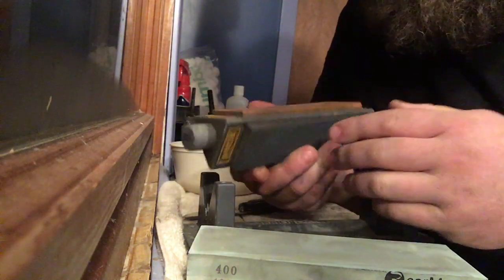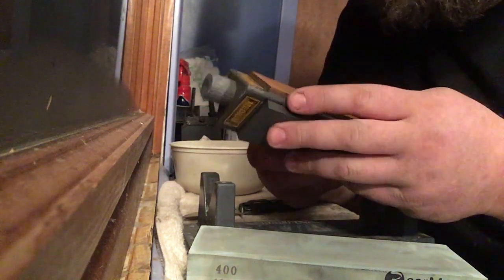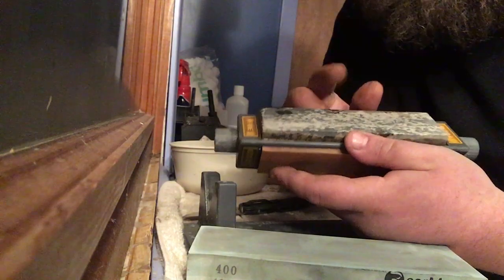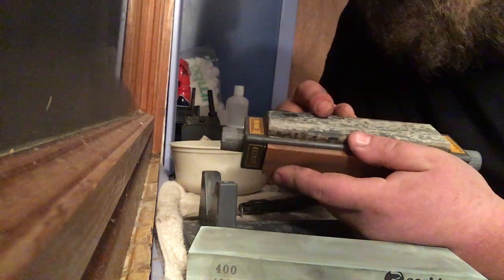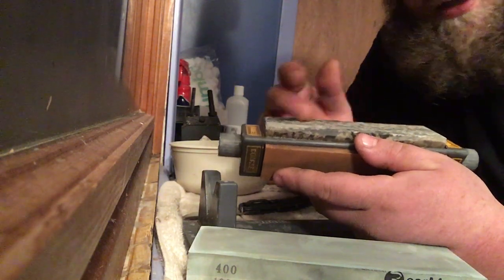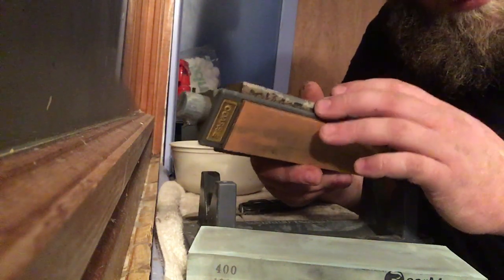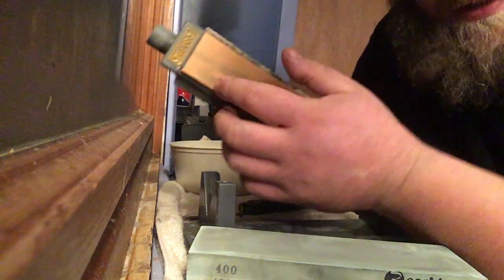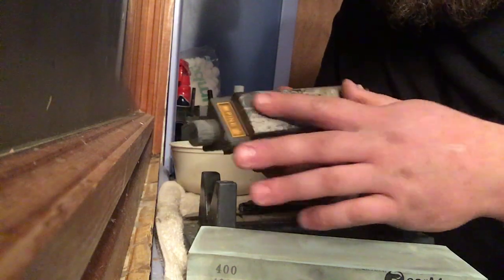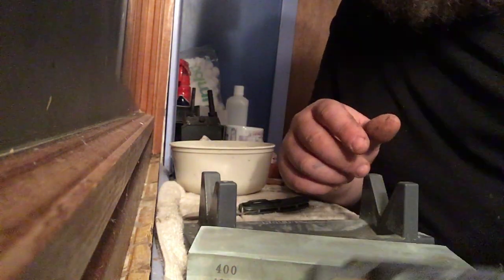I'm going to throw the stone back in the water. On the Tri-Hone, today I'm just going to be using the 600 grit. It does have the 400, which is okay, but these two wear pretty quickly. The 600 I use the most. The 1000 is a very, very good stone — very hard, not worn at all. When these wear out I'm going to break it out and turn it into an oil stone. The instructions say you can use oil or water, but they're better recommended for oil. With water it does clog up, so I'll usually use a little bit of soap to kind of mimic that, which works pretty good, though it does tend to load up fairly quickly.